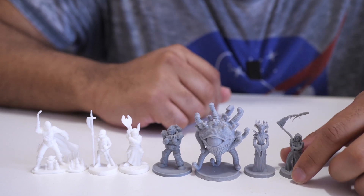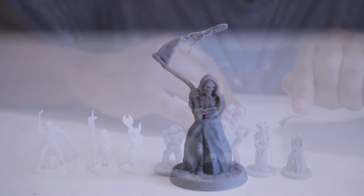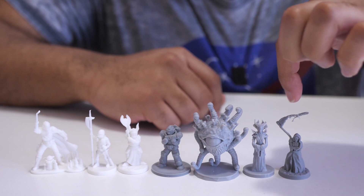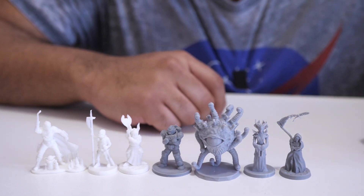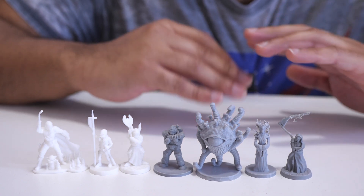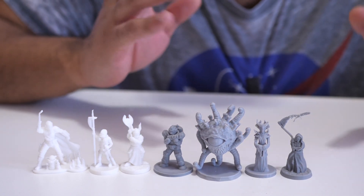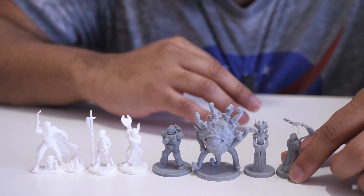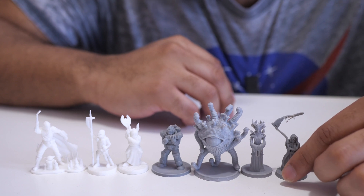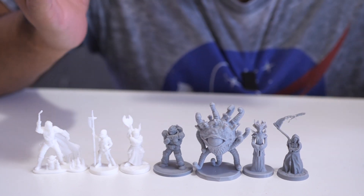The last one is this Grim Reaper holding a scythe. I think that the model came out good, although the weapon, not so much. The reason why the weapon has all this stringing down right here is because this is a pretty steep angle to be printing without any supports. It got to around the middle and then it tried its best to be clean all the way at this steep angle, and it just was not happening. If this had supports, then this end piece here would have been held up and everything would have printed a lot more cleanly. But as far as the skeleton itself, I do think that the skeleton came out looking pretty decent in its details, as well as the little wrinkles in its robe — those came out pretty good and you can still clearly make out what it's supposed to be. The bases that they're integrated on also came out nice and smooth, and I'm not seeing layer lines that stand out to be distracting on these bases at all.